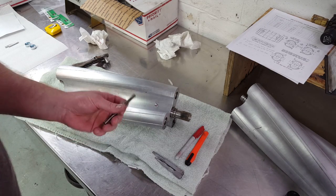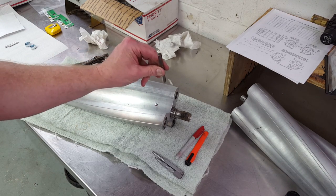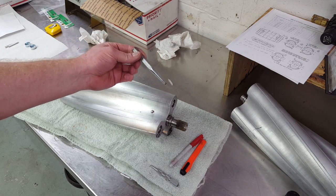When the hammering mandrel starts to touch the edges of the valley of the rotor, it's time to change over to a regular flat punch. I just ground this one recently so that I've got something good to drive with.